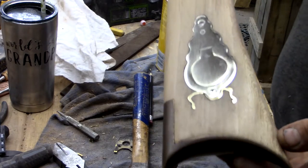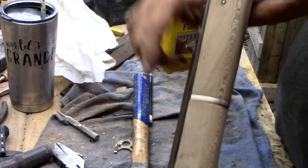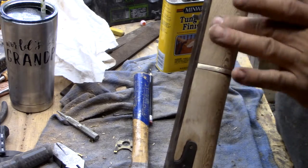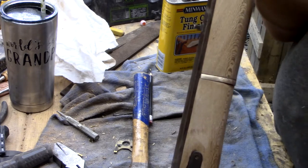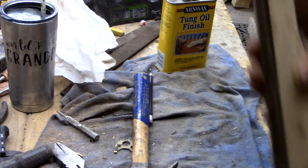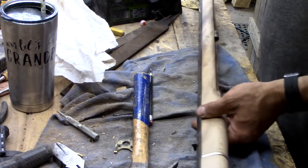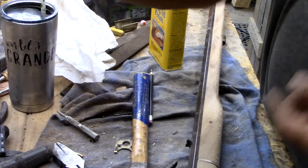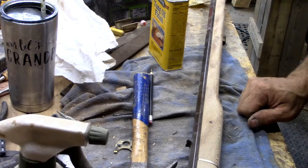Everything's fitted, sanded, and ready to go. This made a big difference - big difference. You'll see a shadow there because these two pieces were evidently sanded separate. This is flush, this is not, so this is the best it's going to get. Sometimes that's all you can do. We've got it pinned, nose cap is flush, the gap is gone - that was what I intended to do, so I've accomplished my goals. At this point we're going to do an old tung oil finish on it, mixed with some walnut stain that I've actually made from walnuts, to give it a little darkness.